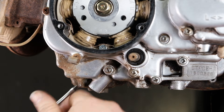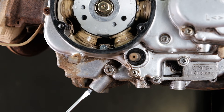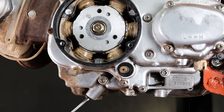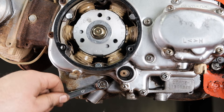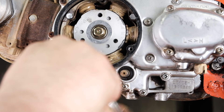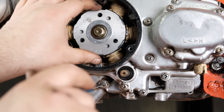I'm going to release the locking screw and jam nut and see if tension comes out of there. I'm noting that on my adjustment screw, it's loose — I don't feel any tension on that spring. I feel a little clockwise turn and I'm starting to feel a little resistance, so I'm going to back it off. You can actually see it coming out there. Back it off all the way. 12 millimeter — hold the screw and break the nut loose.